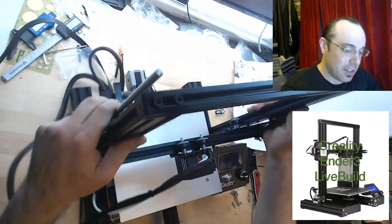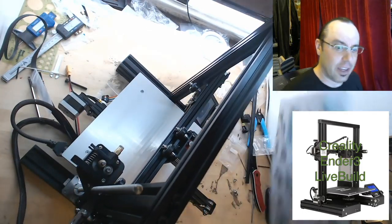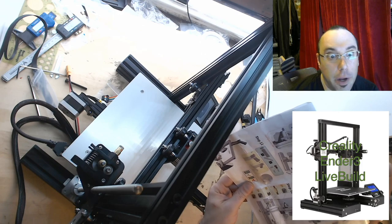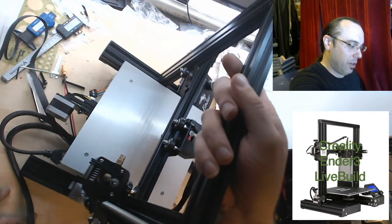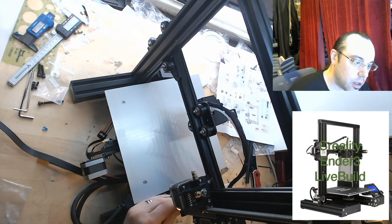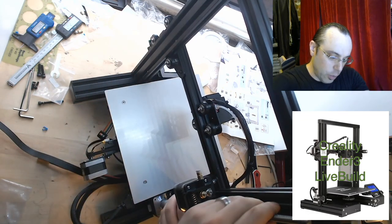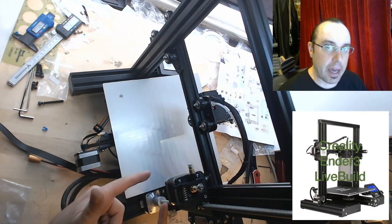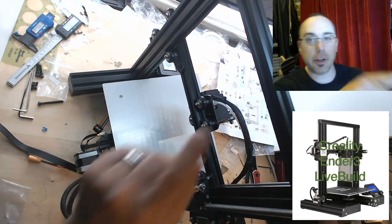Assembling a grown-up Lego — it does feel very Lego. The thing is, with instructions like this, you don't know — it doesn't matter how smart you are — you're just sitting there like 'oh what is that picture.' Cable should be behind the lead screw, yeah that's what I thought. First thing I'm going to do is make sure this feeds up and down very well with the motor not plugged in — hopefully you can see that — so we're not putting any back-EMF into the board to blow out any drivers. Wire goes through the gantry under the top beam.